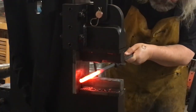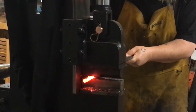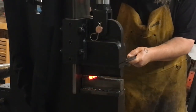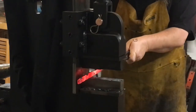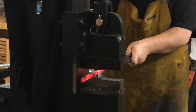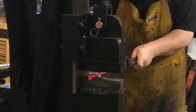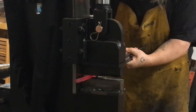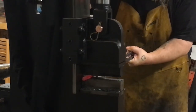Here what I'm doing is I took my piece of steel over to the forge press and I'm going to start drawing out the portion that will eventually become the D-guard. Normally you would do this with a tang, but this is going to be the D-guard. I'm turning it, adjusting it both directions, trying to get the length and the width that I want. Eventually I'll take it over to the anvil after a few passes in the forge press and do some hand shaping there.